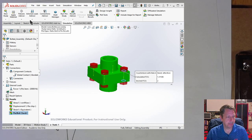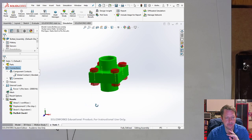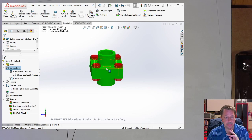The hand calculation for this problem gives a similar factor of safety — around 1.23 to 1.25 — so the SolidWorks simulation and the by-hand calculation generally agree. Going back to von Mises stress, you can see the bolts are slightly splayed, indicating some shear and bending moment effects. The deformation is greatly exaggerated by default; at true scale, the deformation is barely visible.